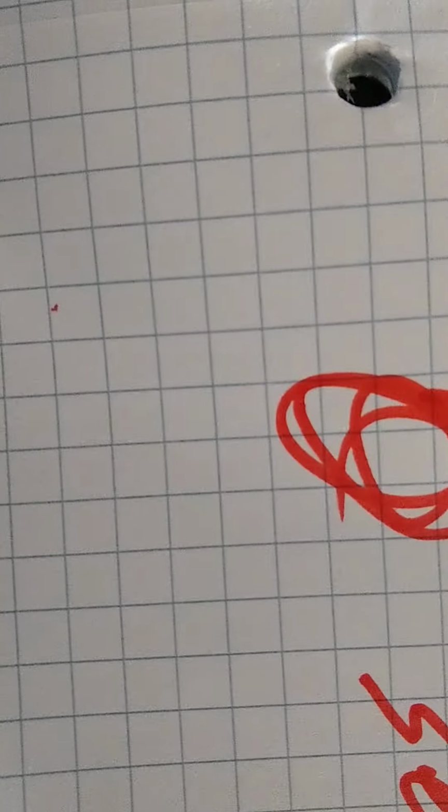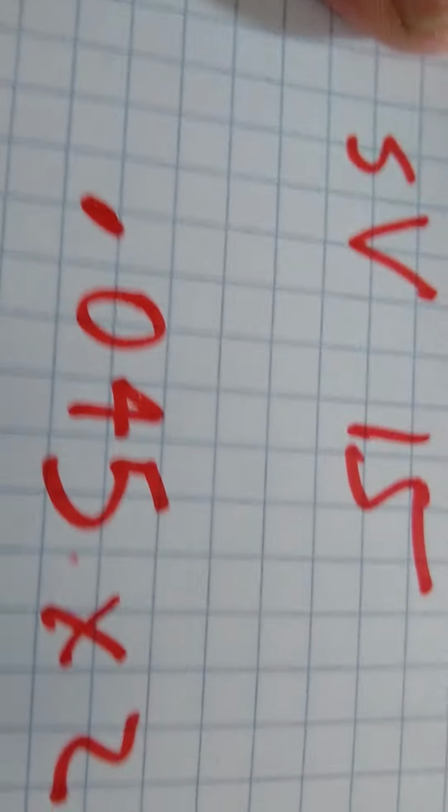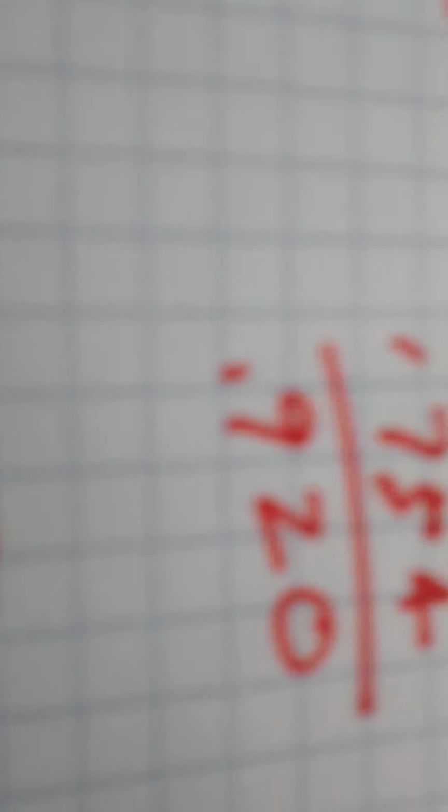And what I've done different than that test, the last video I did with 0.15 in, 0.76 out, is I put an 8 uF cap in series going to the primary. And this boosts the power output from 0.7 to 0.9 average.